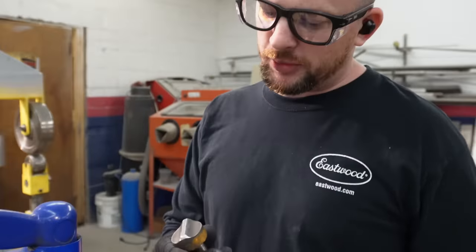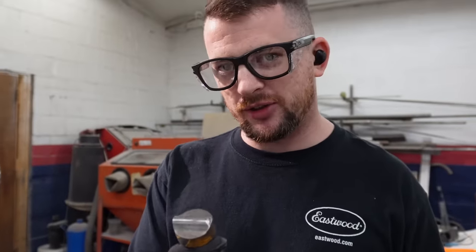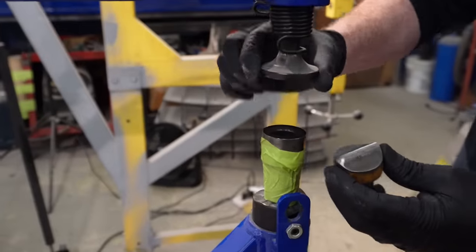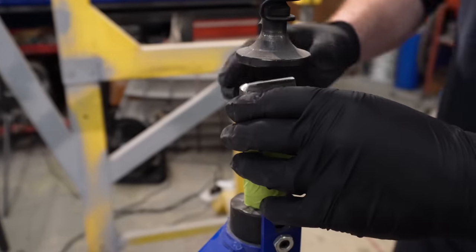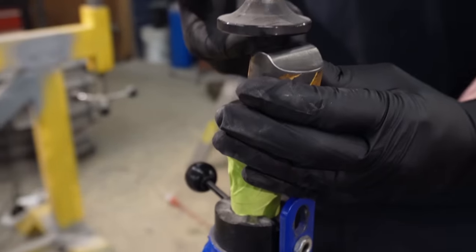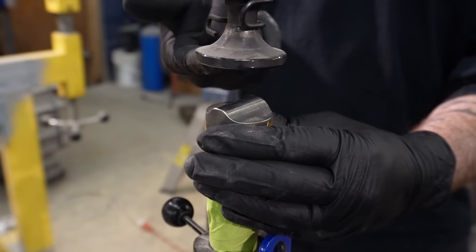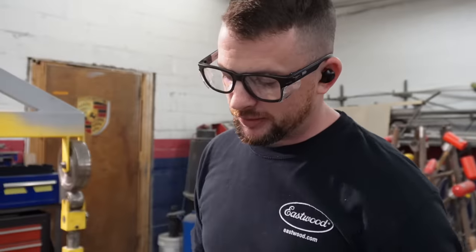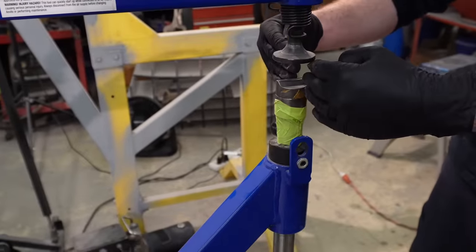All right, so this is what's called a linear stretch die. Earlier I mentioned the Lancaster style shrinker stretcher, which also stretches linearly. It's the same concept, except in this one, you have an air hammer that goes like this, and you have this die in the bottom, which I'm gonna tape so it can't spin. When this die interfaces with the upper hammer, it's going to cause stretch, but only in these directions because of how the die is shaped, which will then cause the piece to curve.